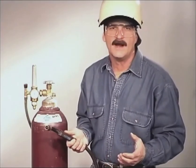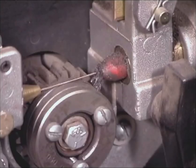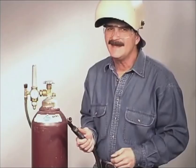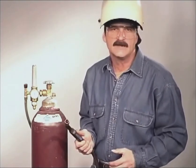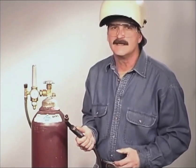As clean and shiny as the wire looks, it still causes dust from the shop to gum up the liner right where the wire goes in. This can build up enough to stop the wire from feeding consistently. Installing a wiper with some cleaner seems to help keep everything operating smoothly. It is extremely difficult to make a good weld when the wire is not feeding correctly. Generally, any problems will not be equipment failure but rather some kind of contamination — either dirt buildup or weld spatter. Take the time to keep everything clean and in good working condition.